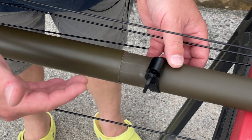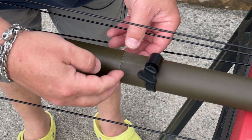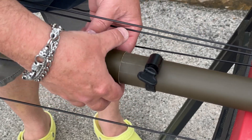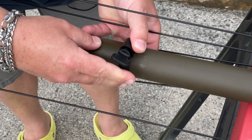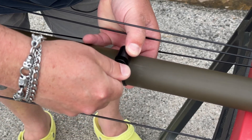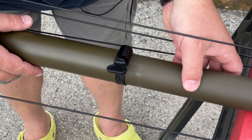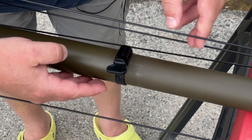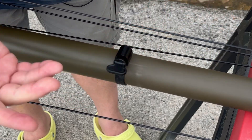Next, on the Expedition model — because this is designed to be portable — are these little plastic thumb hose clamp things. These slide right on top of the next section down. You're not going to clamp it on the fatter section; you clamp it on the thinner section. These are designed so out in the field you can put them on and just tighten them up. Just enough so when the mast sways in the wind — especially on really windy days — it doesn't collapse. I've had mine collapse before because I didn't use these. They keep the mast very secure and are very easy to put on.